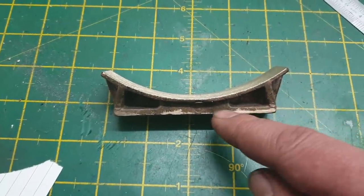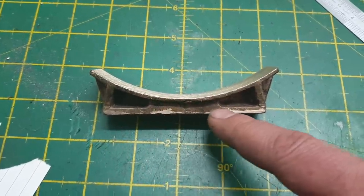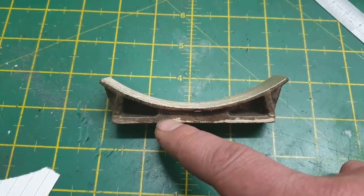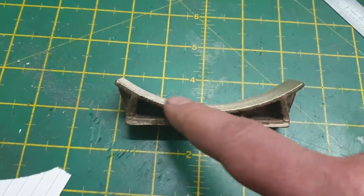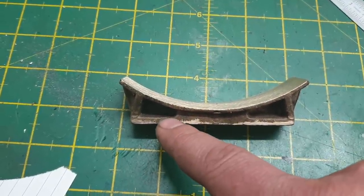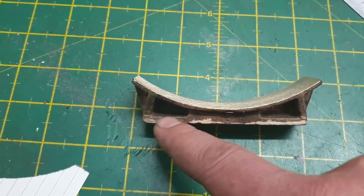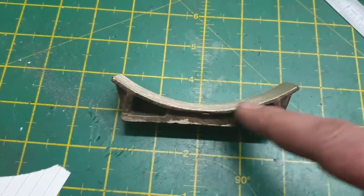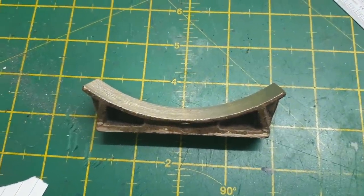Now then, we've got a dimension from here to a finished machined face here of 9/32. Now, had we left all that meat on here, then when we machined up to 9/32, the machining would have gone into these pockets here. So clearly unacceptable. So the meat had to come off here, and that's the reason for that machining up. Right, onwards.